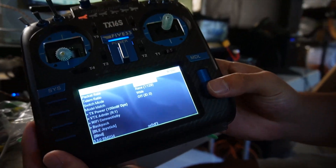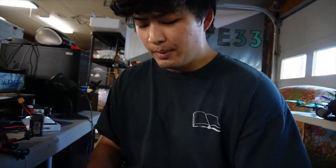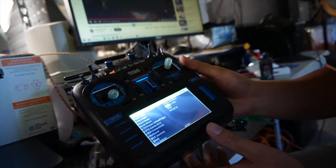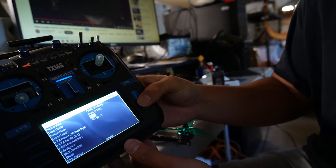The settings I have right now: F500, race telemetry. Race telemetry means you have telemetry when you're disarmed and no telemetry when you're armed and racing. You don't want telemetry while racing because telemetry introduces a little bit of jitter — the radio waits for a signal back and latency spikes. Betaflight wants a smooth signal, so no telemetry while racing.